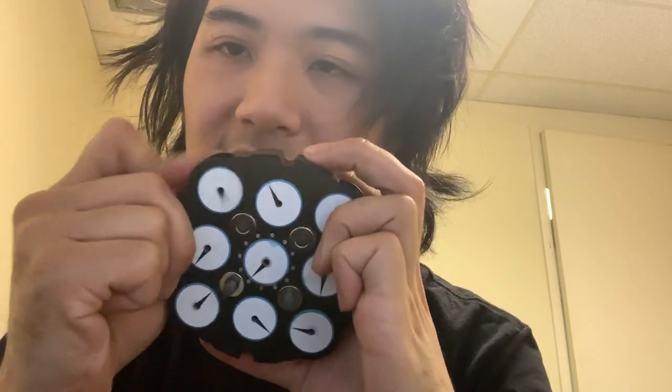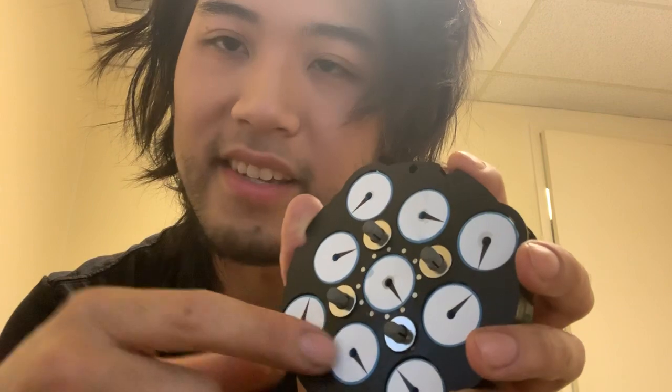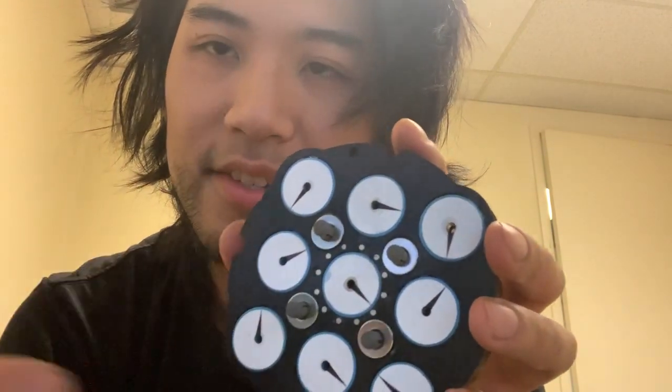It's not that hard to turn, but there are some serious issues. The biggest issue with this mechanism is these aren't indexed. I thought to myself, if you just index the center, then these don't matter, because they have to touch something that touches the center. Except in the case where if you're on one face and you're playing around, that other side can jiggle. This gear for the button can catch until this is turned, but it's catching on these, which is completely different from the lockup. These lockups happen in tandem with the gears not being aligned, because you have two other gears that can go out of alignment. You can see how this is in the middle, and I can touch this and it'll go through.